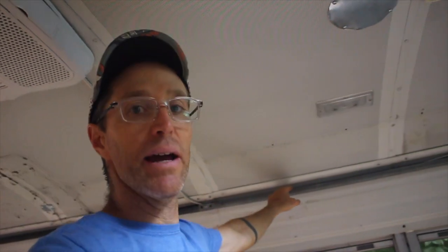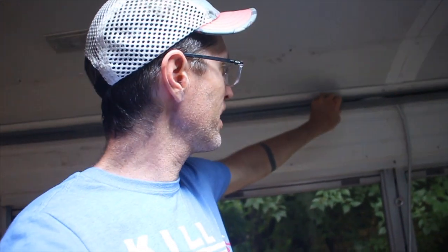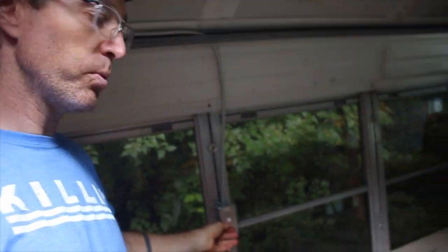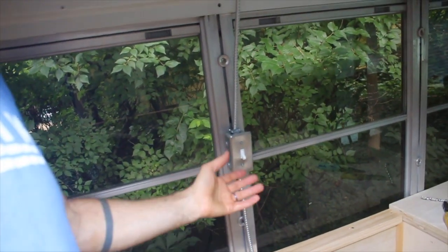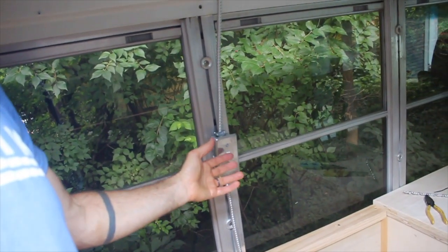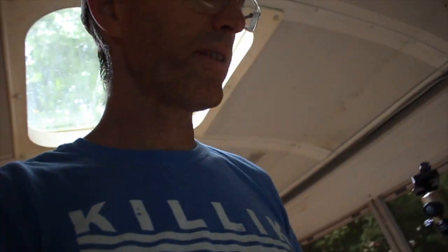You might've seen that. So I've got a jacketed wire here that goes into my conduit, which will be painted white and have some LED lights. It'll look really cool. And I still need to tie this down. And then I've got this shutoff switch. So the shutoff switch is just a way to have a second control on the AC. So if this is powered off, the unit won't run. But I do need to flip the fuse for this guy.